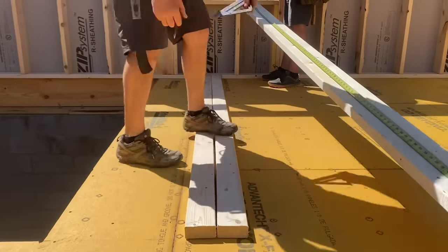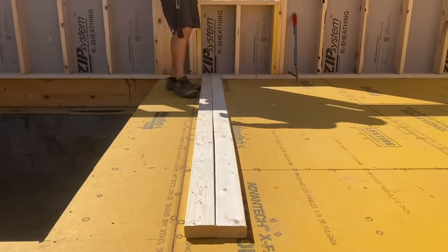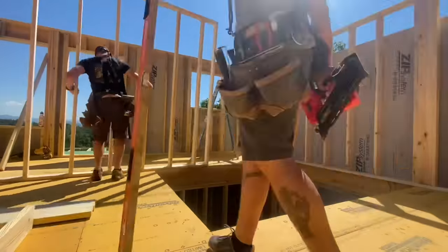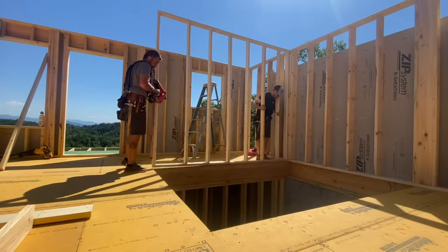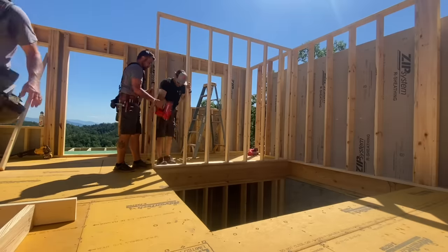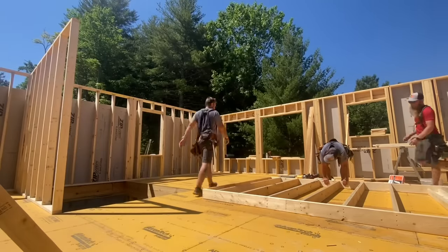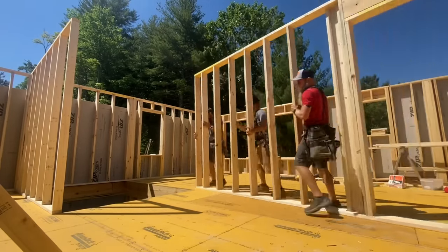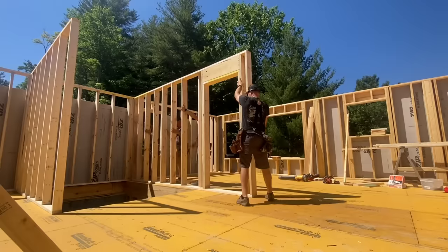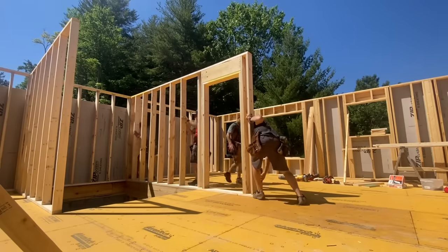With that, we are ready to start laying out and knocking out these interior walls. I like to butt the plates to the exterior wall to pull layout, so I make sure I'm pulling from the outside of the structure on all the walls — that way they line up under roof trusses or floor joists. With these walls that create the sides of the stairwell, it's pretty critical that they line up flush with the floor framing below. I usually don't even chalk a line; I just use my speed square to make sure they flush out so there's not a big bump in the drywall.